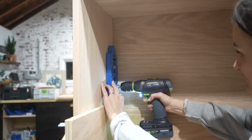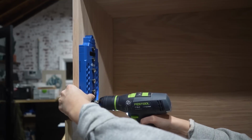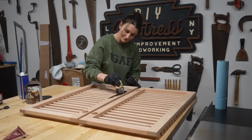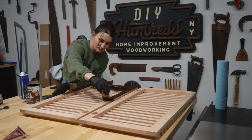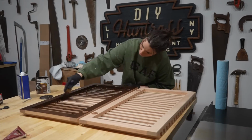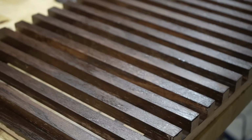You probably don't need a shelf pin jig if you're being picky and choosy about the accessories that you're using for this build. You could probably just drill 1/4 inch round holes into it and do it straight, but I decided to use my jig because it made life easier and I had it on hand. Anyway, once that was done though, it was time to stain, which was kind of a pain because staining anything with slat wood is kind of a pain, but all of the hard work really worked out really well because it looks great.